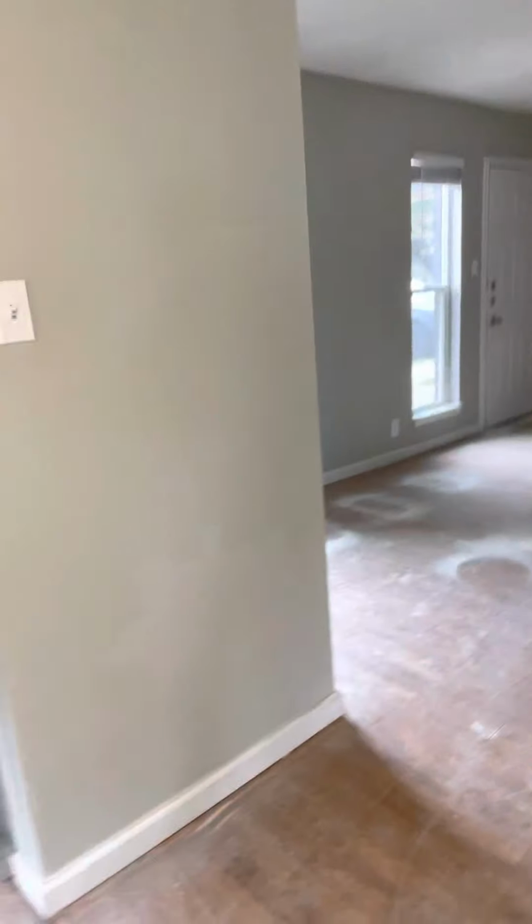It's Armstrong product going in. So we got a 12-foot width. All the grain's gonna be running one direction right here. We gotta make sure the grain runs the same direction out of the bathroom over in here. We're not gonna be pattern scribing over in the bathroom because there's no need to.